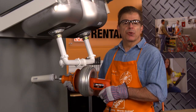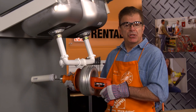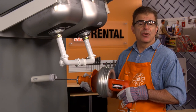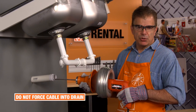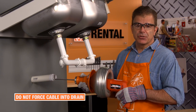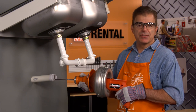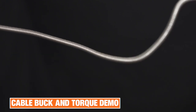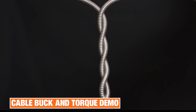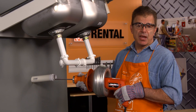Once you get past the first bend in the line, you shouldn't have to pull the cable out of the machine anymore. Just pull the grip shield forward and move the Super V back from the drain — the cable will come out of the drum by itself. Don't force the cable into the drain; you won't clear the line any faster and you could damage the cable or seriously injure yourself. The cable must turn freely as the drum rotates. If it jams, the cable will build up torque, start to buckle, and then in the blink of an eye twist itself into a series of loops. If your hands are caught in a loop, you risk severe injury.